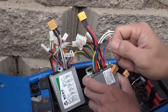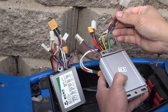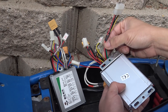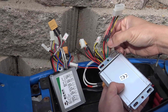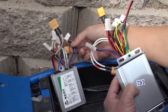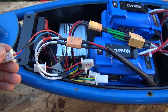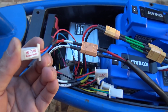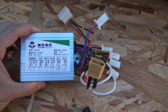You have to hook it up to your motor and try it to see if the wheel goes forward or backward. The third connector I use is the throttle — this is the only three-prong connector in this controller, and usually it's red, black, and a different color. This one is green; I have seen some with yellow. This one here is red, black, and blue. The last connector is the power connector, labeled 'power lock' on the 1000W controller, with no label on the 500W controller.